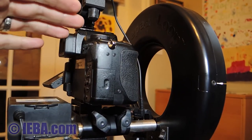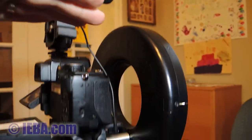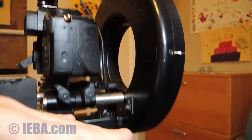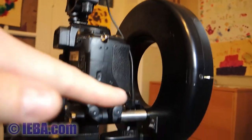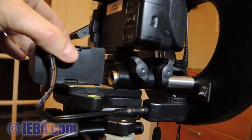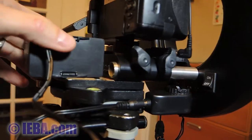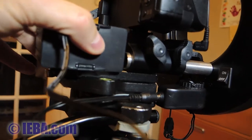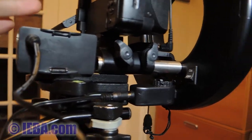If you want a microphone in addition to this, you need some sort of riser to get the microphone up over the light, because the light goes above the lens and below the lens, so the whole harness needs to work together as one complete system. If you don't have a 12-volt source, you'll need a battery. This battery pack I can feed right on the back of the camera plate so it will all come off and go on together.